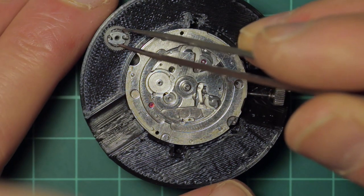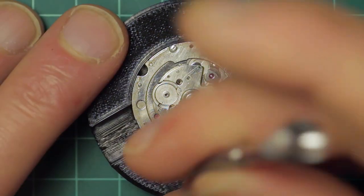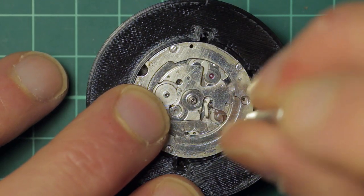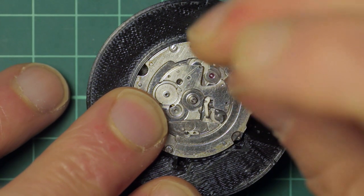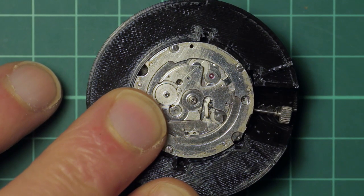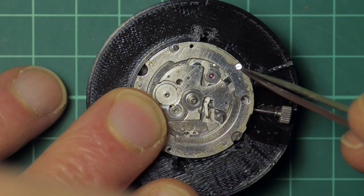This is a two-part gear with a metal upper and plastic lower which can be separated — it snaps together as you can see, and this is the mechanism that moves the calendar ring around. Once the calendar works are removed, there are three screws securing the dial side chronograph. With this removed it reveals the reset hammer and the works for the hour counter of the chronograph.